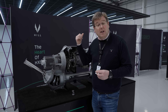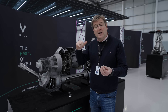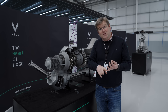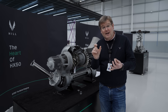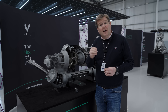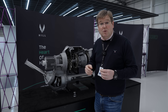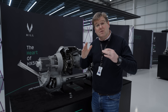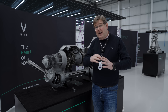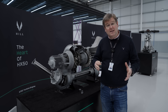This is another hydraulic test rig like the one for the speed reduction gearbox, that allows us to pump a controlled volume of fuel at a controlled pressure into each of the cavities in the back of the fuel nozzle, and then measure the mass flow against applied pressure delta across the nozzle's characteristic, the spray angle pattern, and also the quality of atomization across the range of operating points. Some of those things we'll do with online pressure sensors, some we'll use laser scanning methods to track the particles. The main task now is to get the whole test rig - pumps, pressure control, flow control, and containment - designed and implemented.